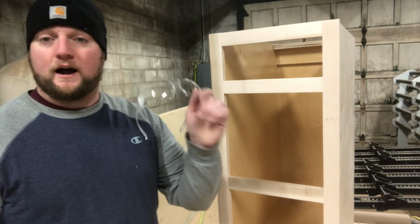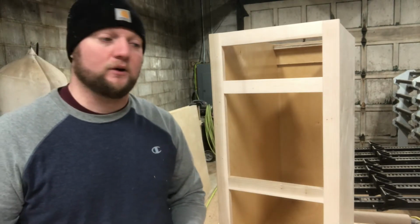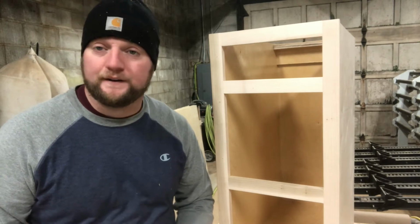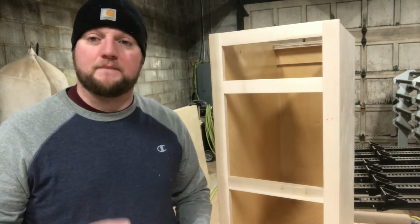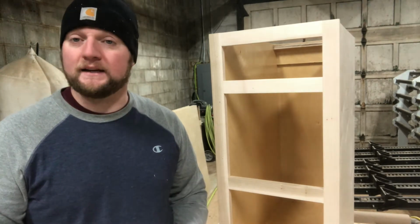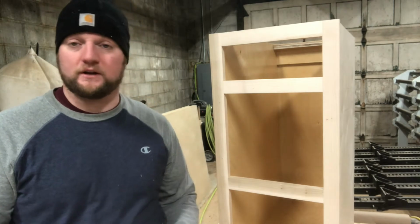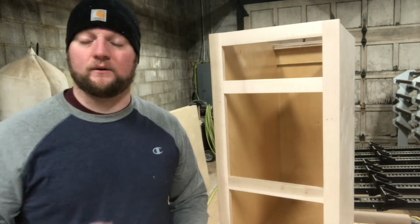You'll want to wear eye protection and ear protection. My table saw is not that loud because it's got a nice sharp blade on there. But there are a lot of high-pitched sounds that can come off the table saw blade spinning at high speeds that maybe you don't even hear but can be damaging to your hearing. So we'll head over that way now.